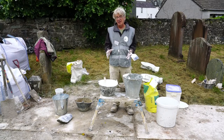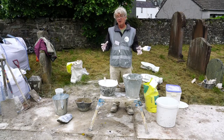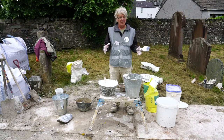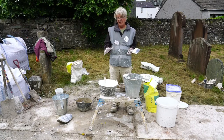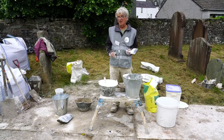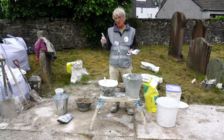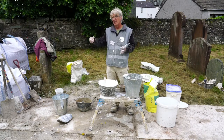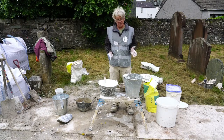But sorry, what I was going to say is, yeah, measured rates. It was for about 200 years in most parts of the country, the measured rate for applying 3 coats of plaster was 3d a yard. And in Swindon in 1860 it still was, but then they were lime washing the buildings after that, and they're getting 3d a yard for lime washing, and I'm thinking, what on earth is going on here? How can that take longer? But the only explanation is the burnishing and the really working of that surface to bring it to an immaculate weatherproof finish.